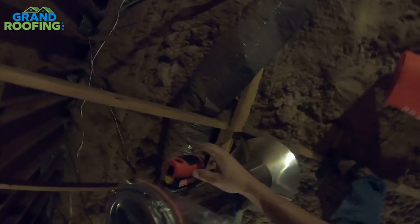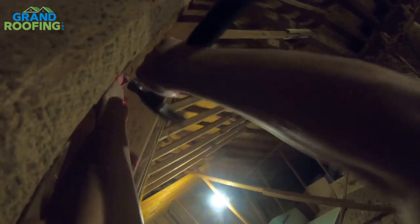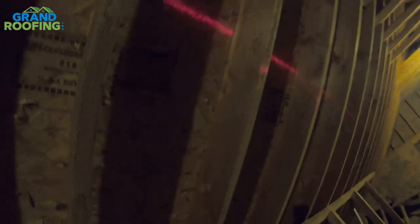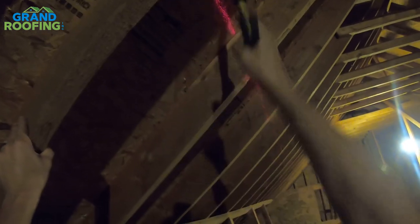We're going to see if this will turn on. The pipe is coming up right here in the center — center-ish — it's coming through, shooting the laser there. I just tried to aim in between the two trusses here. We're going to remove the shingles in that section and then plunge cut where the saw is, open it up from truss to truss, and about the right distance through there.